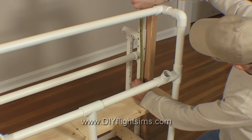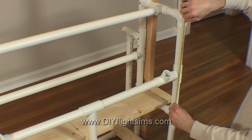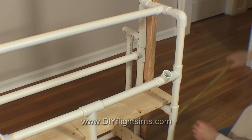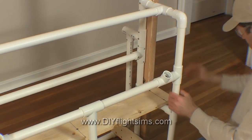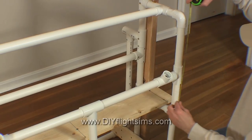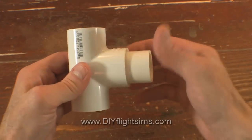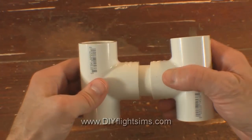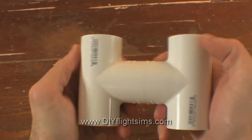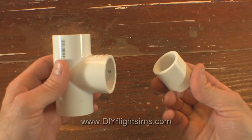There's no way I can predict which manufacturer will make the fittings you will use, so several times during a project we may measure the frame to verify it's even and symmetrical. If I need to attach two fittings right next to each other, I cut a short piece of pipe that I call a 'between' — because it fits between the fittings. It's a short piece of pipe about one and a half inches long.